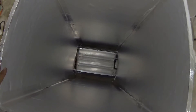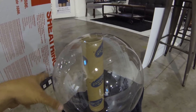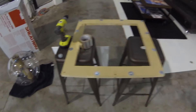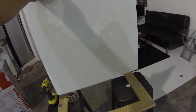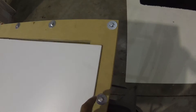So here's my setup. There is the heater inside my heat box. Here I have a 20-inch polycarbonate sphere. I inserted this piece of round cardboard tubing to help support it when I push the thermoformed panel down. And then here I have my frame. I've taken some pieces of MDF particle board, cut out a frame, and this is my 24-inch by 24-inch piece of Sintra — basically foam PVC. I've made the frame six inches bigger so that I can have an inch and a half of overlap all around when it goes inside.